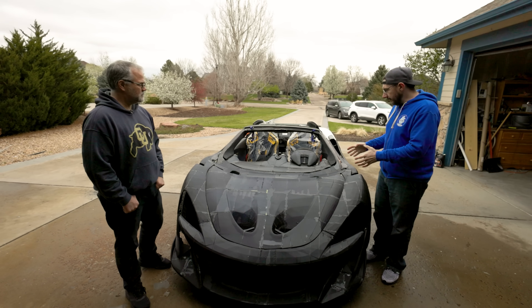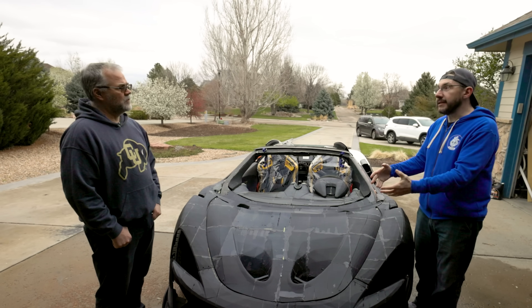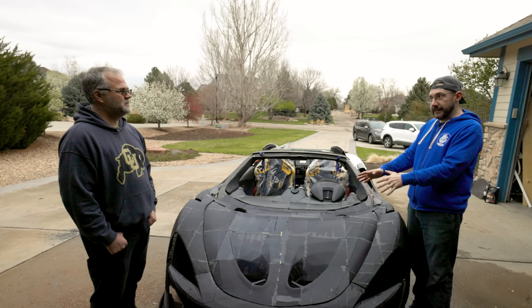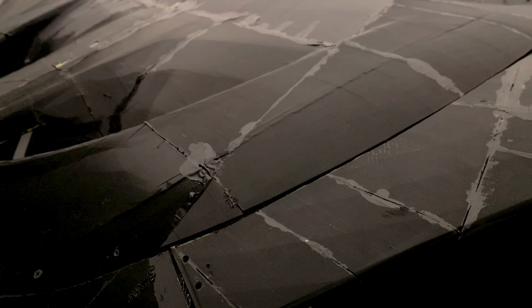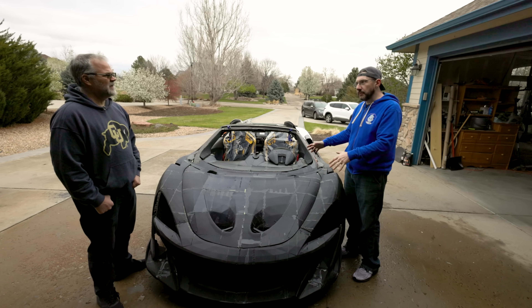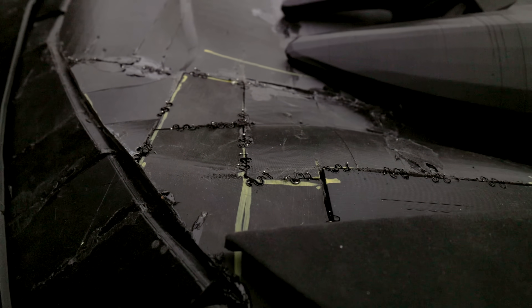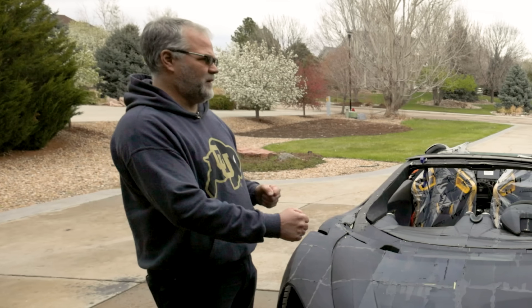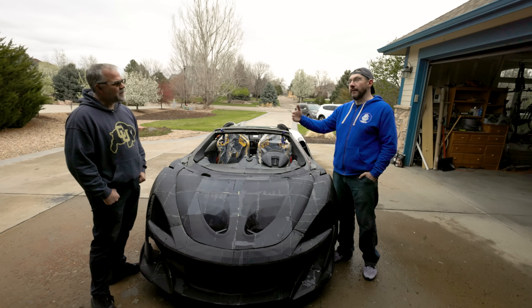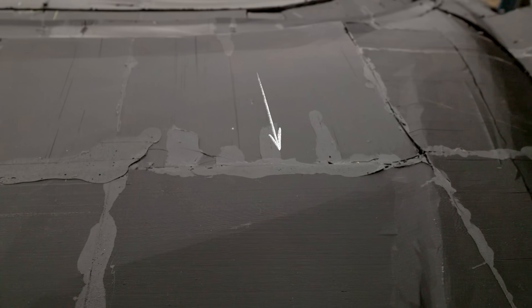On the front end here I see a mix of things — there's metal under here supporting this that you added. But these are 3D printed ASA parts, and I see drywall screws. I'd imagine those are temporary, just to hold things in place — that's correct. You've got a lot of the plastic joiners, which are super handy. I'm really rough with these prints — I'm stretching them, pulling them, trying to make them all fit, hitting them with a heat gun. ABS glue with ASA makes sense that it works — it actually fuses the parts together at a chemical level.